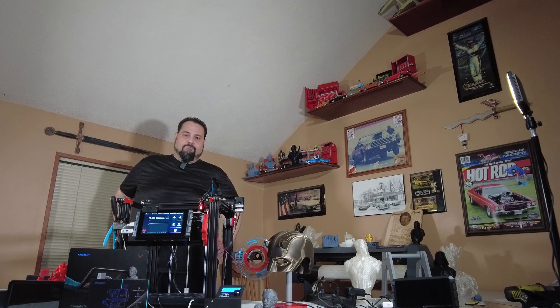I did print supports for this because on the Plus you get 20x40s, but this is a 20x20. On the Plus it's doubled up on the side with the Z plate because it has dual Z screws, so there's an extra 20x20 bolted to the side — triple bolted over here, really thick. On this it's only a 20x20, the same size as your gantry. If you pick one of these up versus the Plus, this is half the weight — and it's not just half the size, it's half the strength.